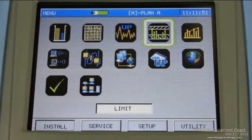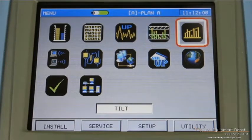The next icon is limit test. This essentially is a full channel plan scan that gives you pass or fail results — are all of the channel levels within the limits that you want them to be at that particular location. The next icon is tilt, not commonly used by an installer. It can be four to 16 selectable channels and gives you an overall view of the channel plan flatness — do you have an extreme tilt or not at the house?